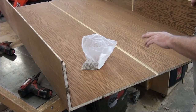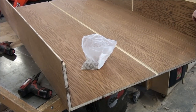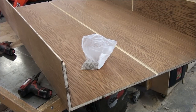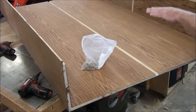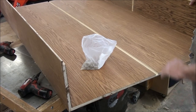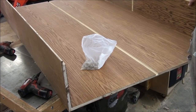one is aligned with the bottom of my rabbet here, so that it goes straight across, because I've got a piece of plywood to go straight across here. So if there's anything out of whack with this dado depth, this groove depth, in relation to the height of that panel, then I can possibly fix my mistake, fix the discrepancy, however you want to look at that.